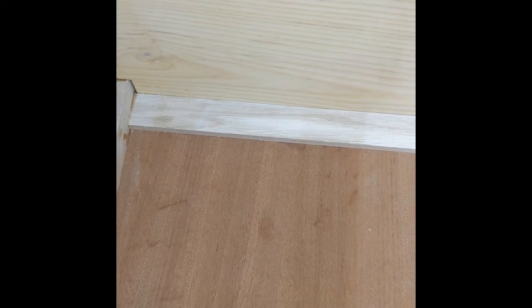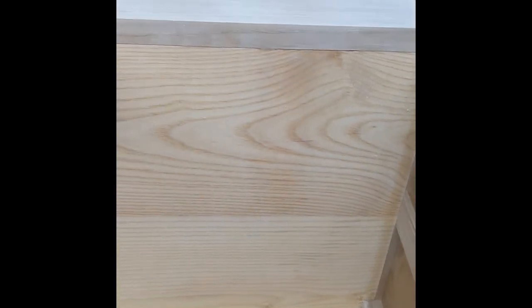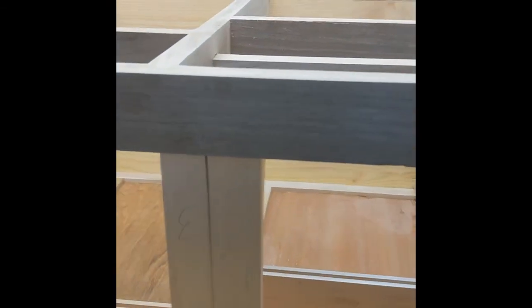There are a couple of dados in the rear. If you look at the web frames, it's dadoed in the rear. The bottom bookshelf is actually three-quarter-inch wide ash - two boards glued together - that's glued to the front in a slight rabbet in the front frame panel, and in the back it's dadoed into the back bottom rail, not glued, so this thing can move front and back. It's finished on both sides and fastened just in the front; the back movement should be invisible.